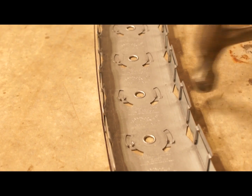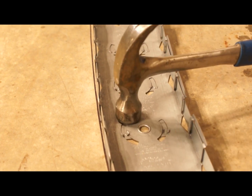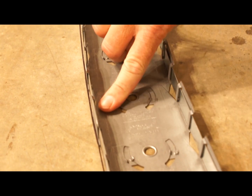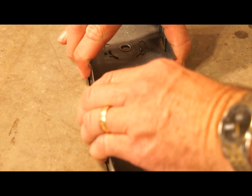To secure the track in this shape, all you have to do is hit these tabs with your hammer on the concrete and it locks them instantly. When they're smooth to the touch, it's locked and it won't pivot anymore.